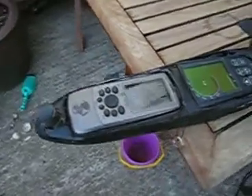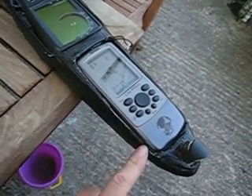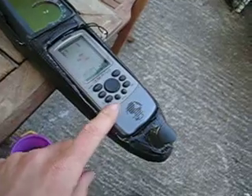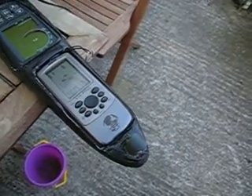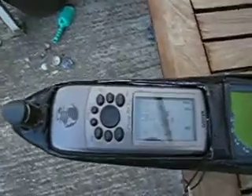This is my GPS 76 in a pod which I use for hang gliding. The pod is made of aluminium up to this point and the front part is made of wood. It's made of wood because this GPS has got an antenna which detunes badly when there's anything metal behind it — any large pieces of metal I should add.